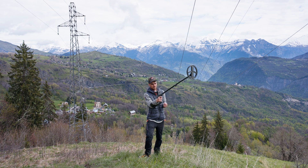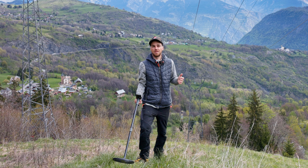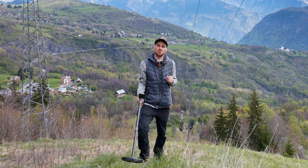Lift your coil and see if the device is still unstable. Obviously, it's due to those power lines right above me. In this case, the detector is always unstable, so we're dealing with an external element that interferes with the device. This is often due to electromagnetic interference, EMI.